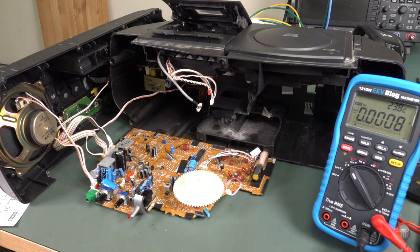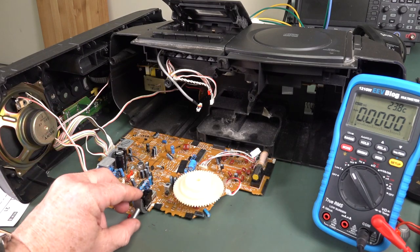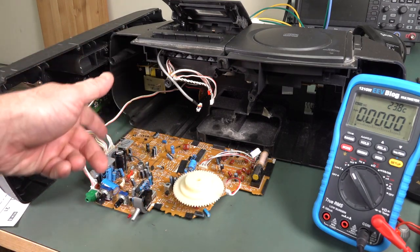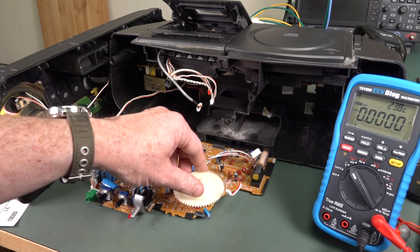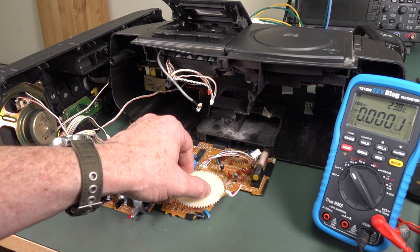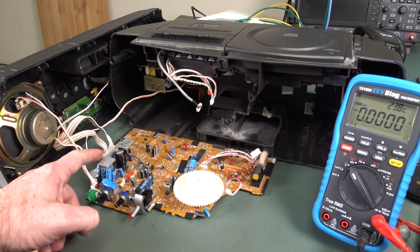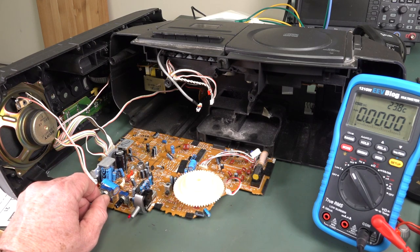Let's power that back on. I'm pretty darn confident that's the issue. There we go. It just faded out — I kind of remember it doing that. As you turn it off, the capacitors discharge and then it instantly cuts off because there's a standby feature. It can't pick up anything in here, even AM. Pretty confident that sucker is fixed. Classic fault in the joints of a power device — in this case the main power amplifier chip. But you'll get it on main amplifiers, individual power MOSFETs or BJTs.